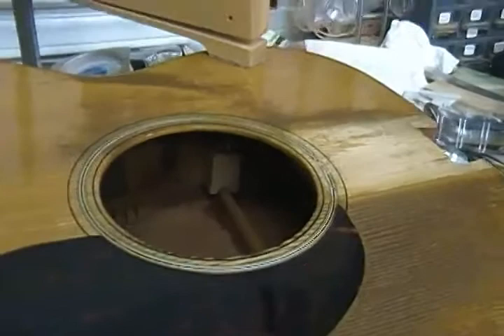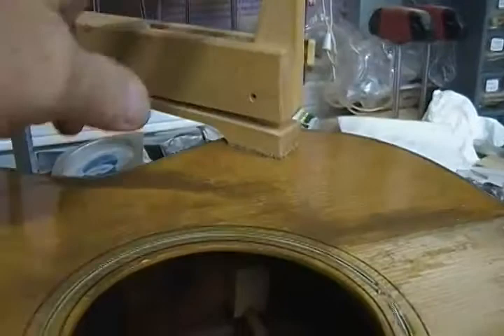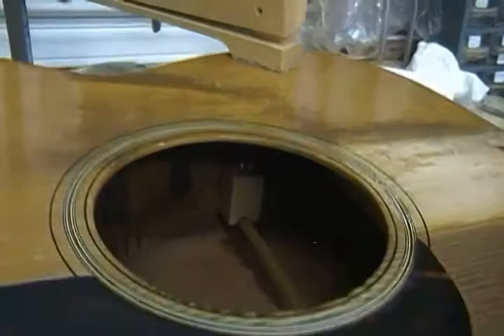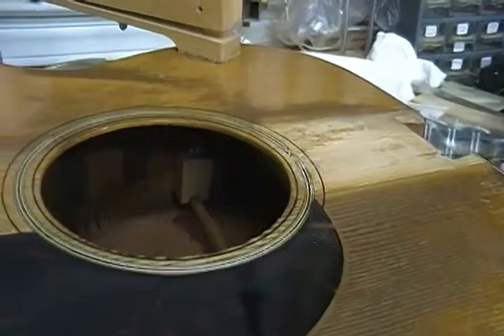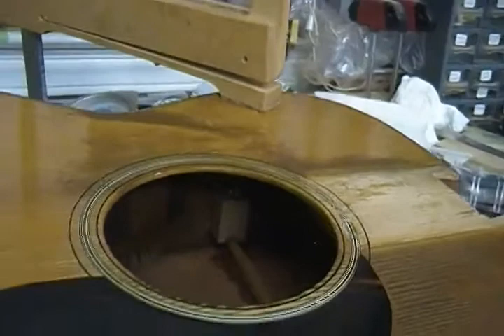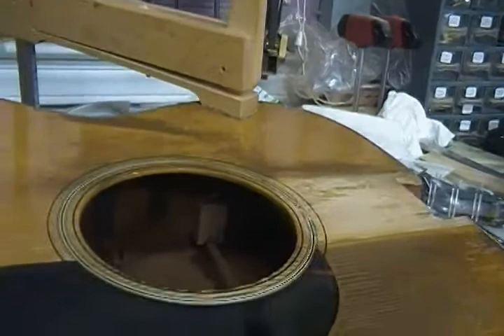That's strictly because I'm lazy. Now, I've kind of — because I'm using the outside clamp feature — I could probably do them without that, it's just kind of a safeguard. But once I glue one, I can't exactly glue another one because I've got to flip the guitar around to get the glue behind the brace. And if I start flipping this guitar around with a clamp on it, I'm going to fling the brace off and things are going to get messed up. So I've just been taking my time, gluing one every night. Like I said, I'm about four in.